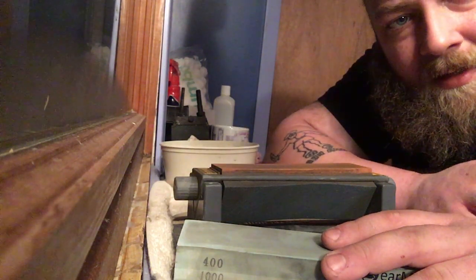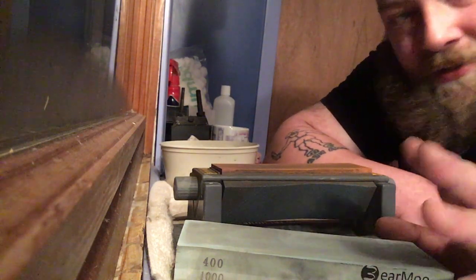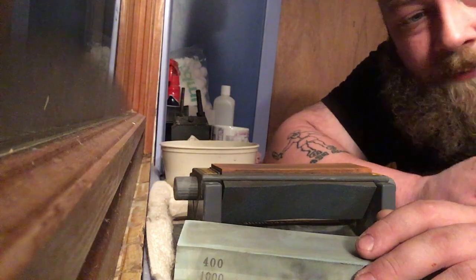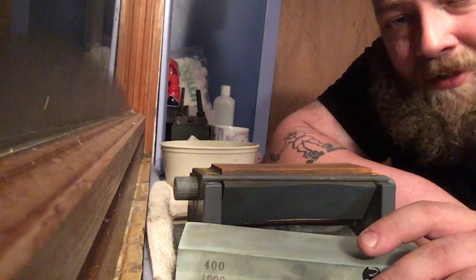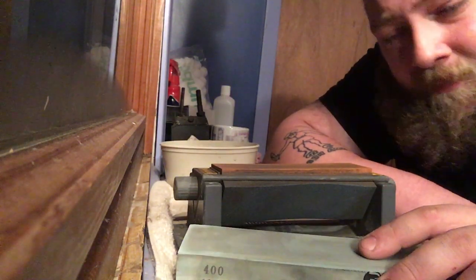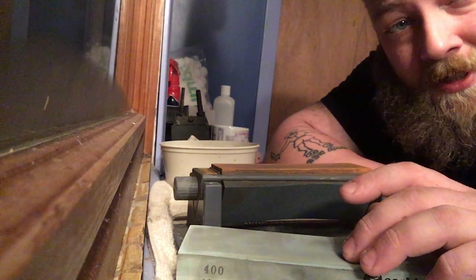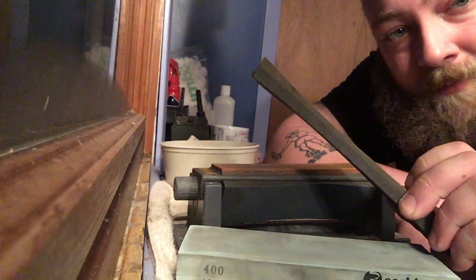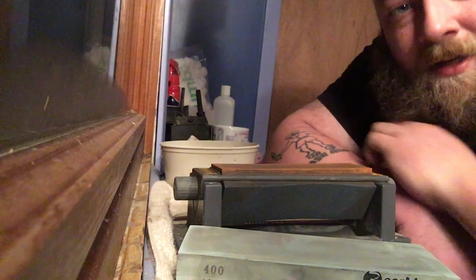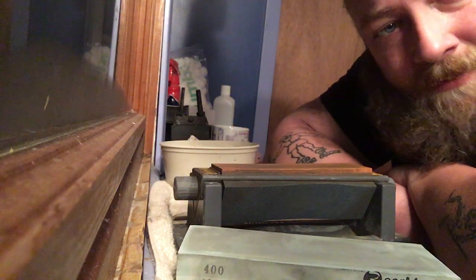I also have a couple from Blue Sun — about the same. They're definitely not true grits. When I first got them I tried to do mirror polishes, because they claim to go up to 8,000 grit. I just haven't found that to be the case. My 6,000 grit from the King KDS feels much smoother than even their 8,000. Out of the four, the 400/1000 I'd say is decent and I'd recommend it. I'll do a video about these — sometimes you do get what you pay for. This cheap stone here though is a very good stone. I've had it about three years, it's pretty hard, very worn but it's lasted.